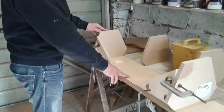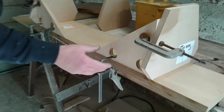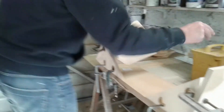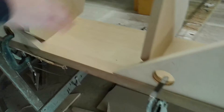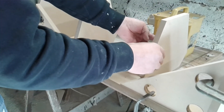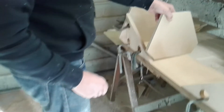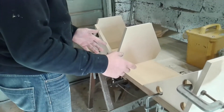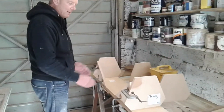This is one of the speakers face down. I'm starting to put these brace pieces in — they're glued in, and this little bracket here obviously comes off later. I've just got it here to keep everything square so that these are totally upright. These two come in later when these are dry. The bass speaker will go somewhere in the middle, this one will have a hole in it to let the bass sounds through, and then there'll be two port holes which will let the bass out at the front of the speaker. Every speaker has its own specifications in terms of the volume that should be around it — that's all been worked out in cubic centimetres. If you wanted to find that out, if you're making your own speakers, you'd have to do a Google and work out exactly how much volume it should have.